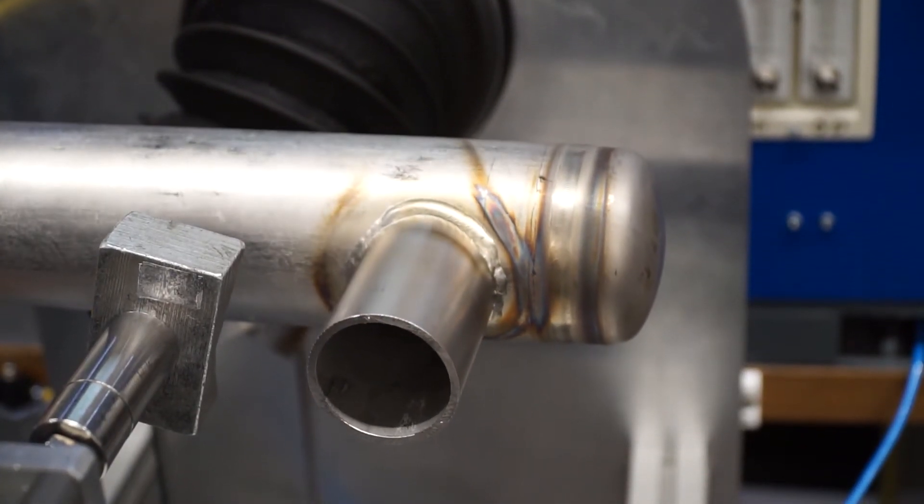We are here in solution engineering and I'd like to talk to Susanne Baumbach and ask her about the application and why the customer would need such a weld seam. We have here a sample for a cooling manifold for a nuclear fusion reactor. The customer can't accept hand weld seams because he needs complete traceability, and otherwise he has to take care of safety reasons — and finally we have to use in this case three-dimensional orbital weld seams.